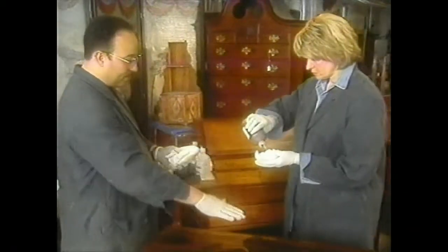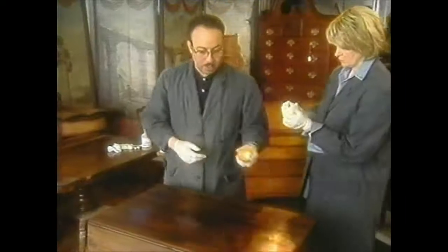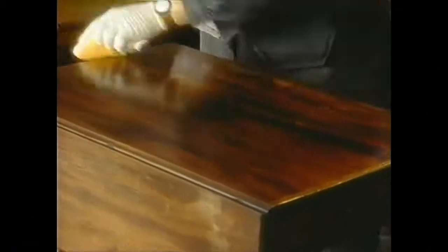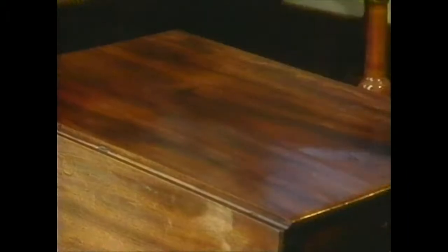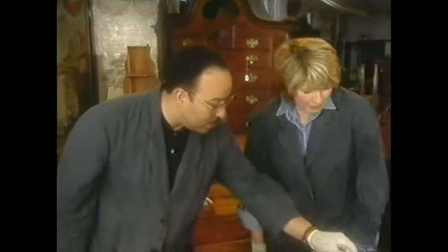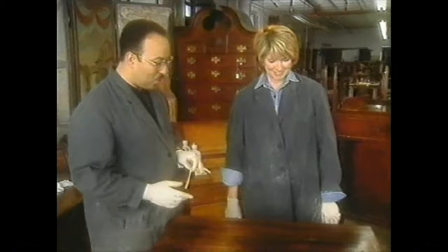Put the shellac on the inside of your pad and work it through until you see it. It might feel a little tacky, but that's what happens. Turn the pad inside out — you come in and go out, come in and go out — and already you begin to see the finish. The shellac enhances both the color and the clarity. If someone polishes this table for an hour or two doing this, you can add about 500 coats — no brush, only a pad. We use a brush only on carved chairs when necessary. It's really altering the appearance of this table, and these remaining spots will disappear when Elias continues polishing. It'll take many more hours and many more coats, and when it comes back they'll be virtually gone.